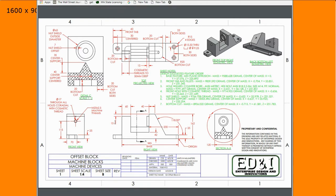Let's take a look at our base feature. What we're going to be doing is sketching on our right view. We're going to start over here at the origin. As I mentioned in class, we're going to go up and over and then diagonal, up and down and side and so on until we get back to the origin. As we're doing this, we're going to pick up sketch relations along the way — vertical ones, horizontal ones. If we're going to go off at a diagonal, it's not going to have a sketch relation.